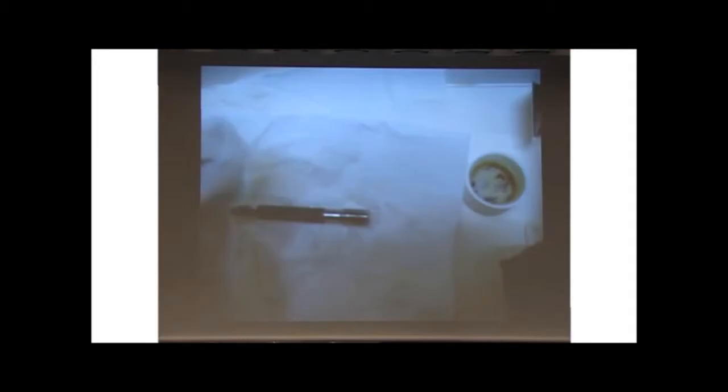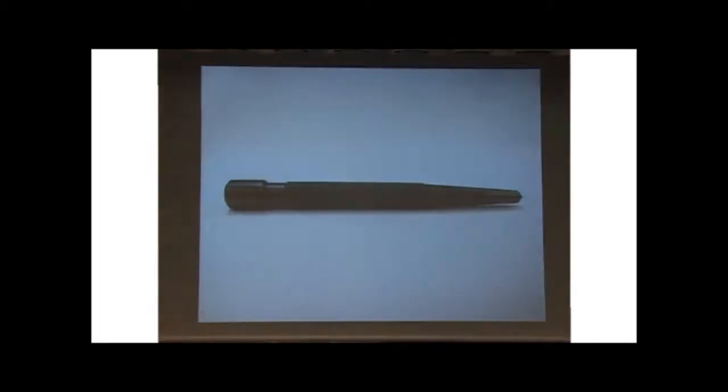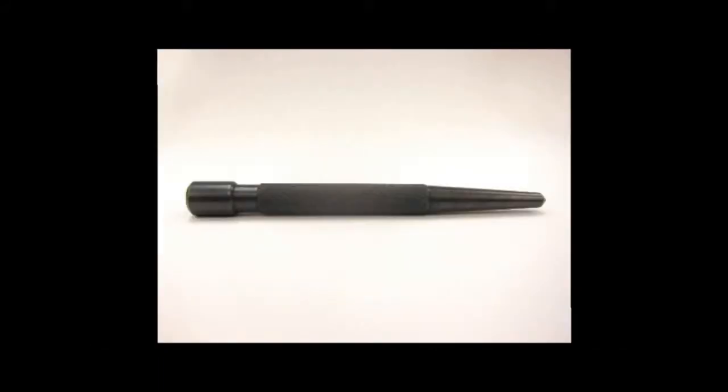You can really adjust the material parameters by just changing the temperature and color — super simple, don't even need to print it out. After all of that I applied a chemical finish to oxidize the surface: steel has two oxides, one orange and flaky, but also a nice black-blue deep one that works as corrosion protection. I did that afterwards to give it a nice finish — a simple thing made in about four hours with just the lathe and some chemistry.